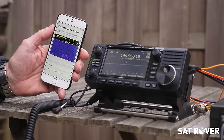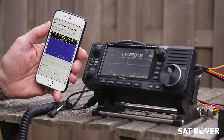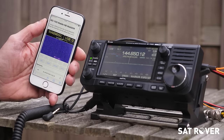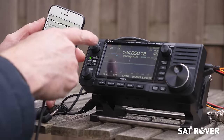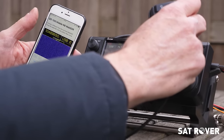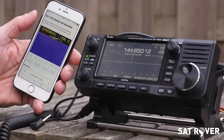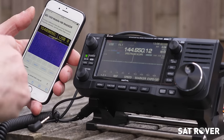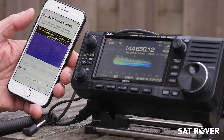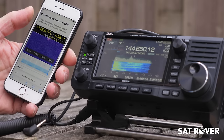Now we're gonna check our signal over the satellite. I do that with the web SDR, the QO100 mobile web SDR from the BATC. I switch over to USB. I turn on my microphone gain again, and I'm ready to transmit and to hear myself back on the web SDR. I tried it. 1, 2, 3, 1, 2, 3, hello. 1, 2, 3, hello.